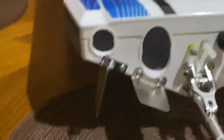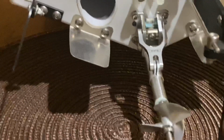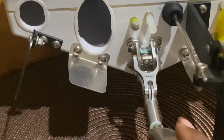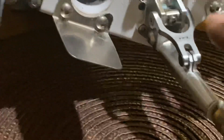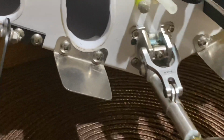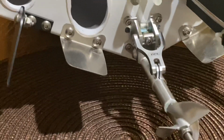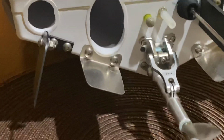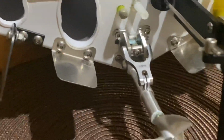All right, while I'm back here on the back of this carriage, this is where I installed the new adjustable strut. It's a TFL from Offshore Electric. That's sweet. Just stick the tool right there in the center, spin it back, spin it up. Right now she's sitting at 0. I can go 10 degrees up, 10 degrees down. Nice piece. Probably the next thing I'll upgrade is trim tabs.